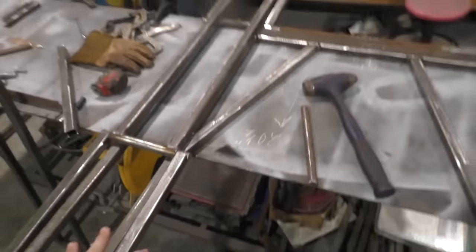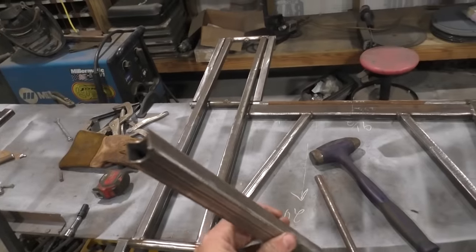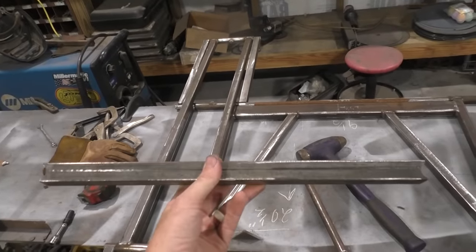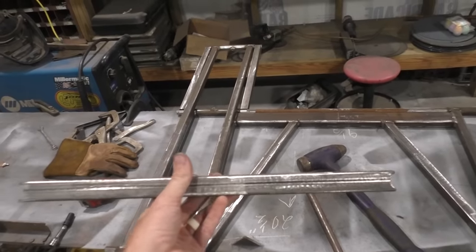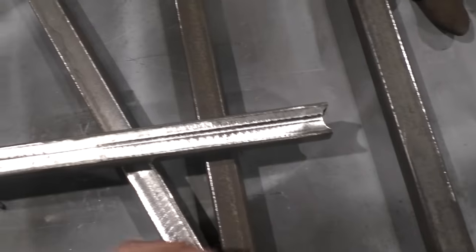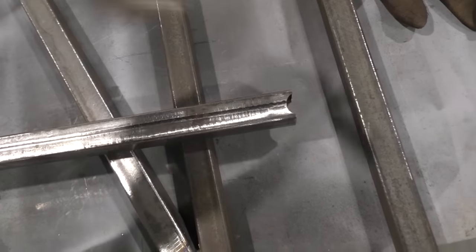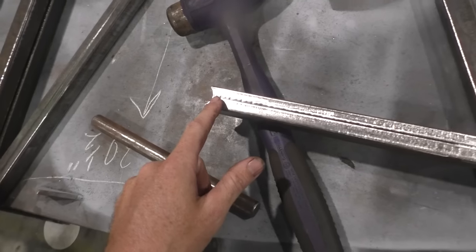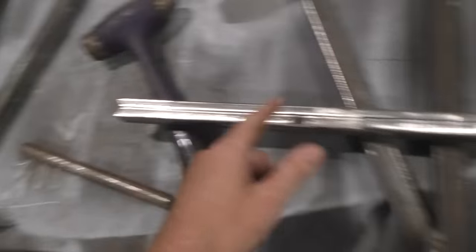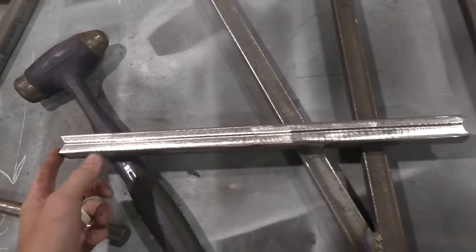All right, now that being said, then you need to get some 1x1 square tubing, 16 or 14 gauge, probably 14's best. I cut mine at 17.5 inches end to end, but I took a 3/4 tubing notcher, and I notched it 1/4 inch on each end. So it's 17 inches from inside to inside of each notch, 1/4 inch notch, 17.5 outside to outside.